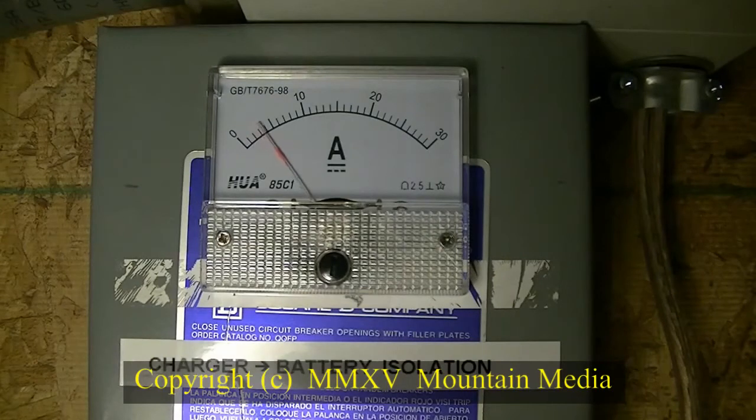Then I spent the next several days making observations and recording output levels. Of course, as Murphy's Law would have it, the windy season here hasn't been too windy. But even then, something with the turbine wasn't quite right. When the wind was up at around 12 to 15 miles per hour, I was only getting 6 to 7 amps. I finally called Bob at Thermodyne, and he was immediately helpful.